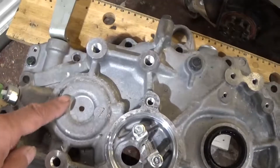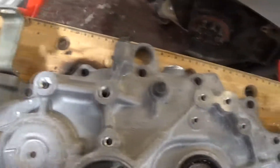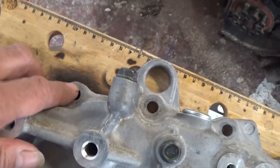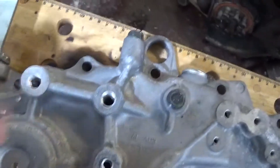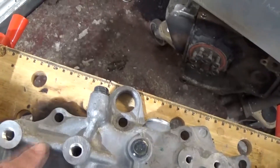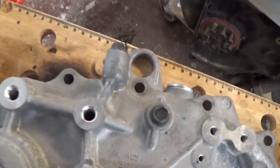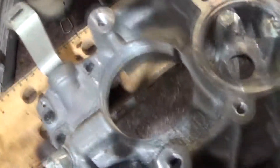I'm going to cut the hole out, then come back, get my aluminium plate and sit it on top. I've got some drift punches — centre punches of various sizes. You get the one which is a very nice fit within the hole, it has a point on it, and you just tap it to give you the dead centre of the hole. I'll probably tap a couple through first and then drill them to make sure they're exact. Once they're drilled and the plate is bolted it gives me the exact position in case any of them move, so it's best to do one first — drill it, tap it and bolt it. The hole's been bored out where I've removed the gearbox off the top of the leaf motor — I'm going to use this as a template only.